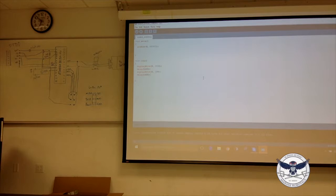You can actually get around using digitalWrite high or low by using what they call direct port access — essentially taking pure C and using it inside your Arduino code. It's not something you have to learn; you can program fine using digitalWrite. But if you want to toggle between high and low very quickly, you want to learn direct port access. The Arduino IDE is cool because you can use pure C in it, and people have even put assembly language in the code.